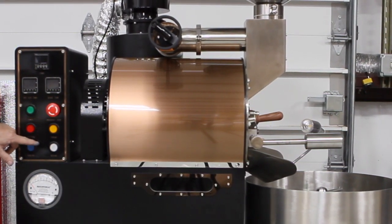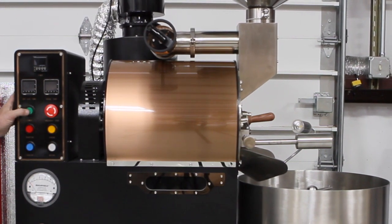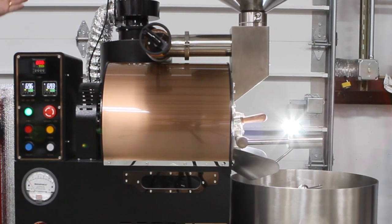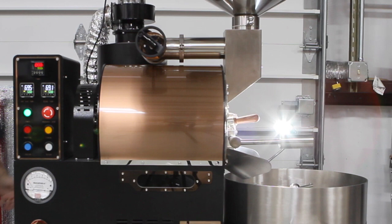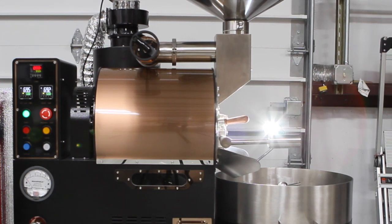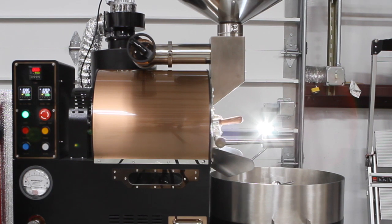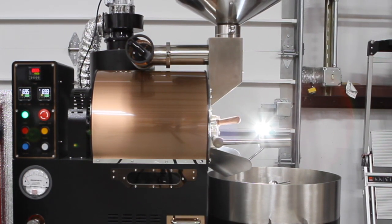You've also got the mixing buttons for the mixing arms. To turn on your machine, power it on with the power button. You should have your fan on — if not, check the back button that should be lit up in green. And if you've got your gas line turned on, you're ready to hit the igniter button while the front valve is closed to light the pilot light.